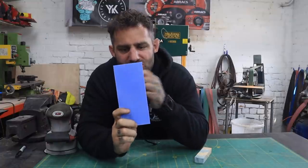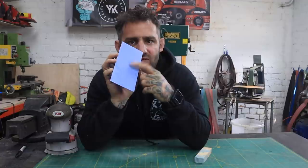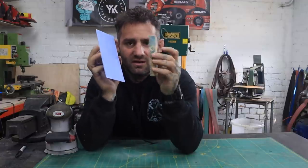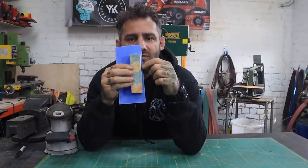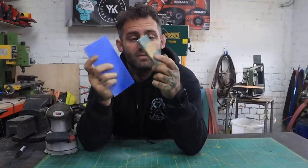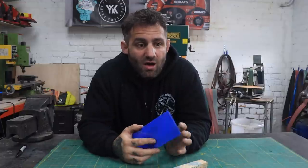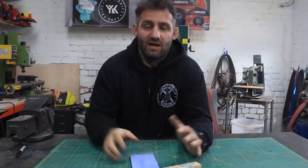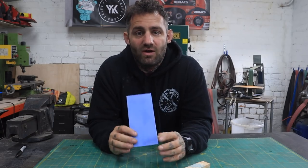You've got to remember though, because the pad is flexible it'll round over the edges, so oversize your G10. I'd glue probably about two or three mils in from the edge, which you probably would anyway. Obviously on the smaller parts it doesn't take too long at all, but this has really helped me when I've been doing batch orders. If I've got about five knives all with the same liners to glue together, I'll leave it as one big chunk of liner and hit all the way over it with the random orbital.